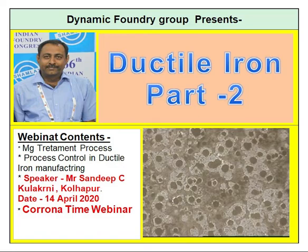Stream inoculation is another way, that is while pouring from pouring ladle to mold, you can put it. For ferritic grade, it can be used more predominantly because it will give you good ferritic structure, good ferritic matrix. So stream inoculation is important in ferritic structure mainly. Mold inoculation some people are using, but in India it is not a much popular thing.